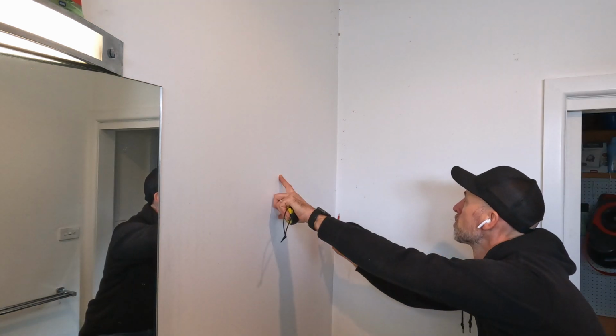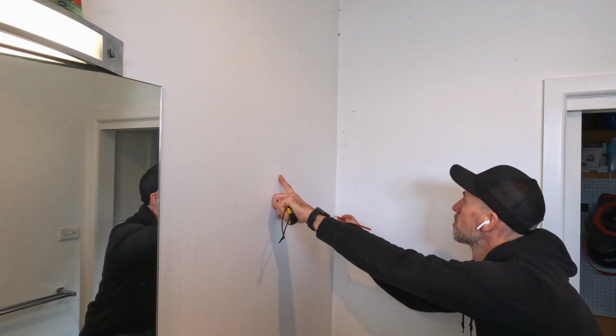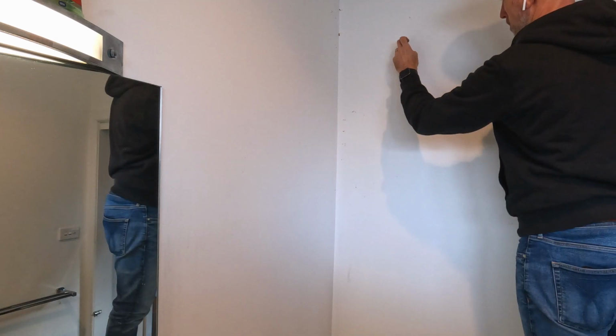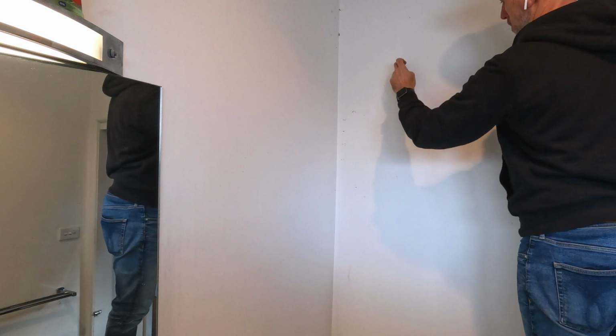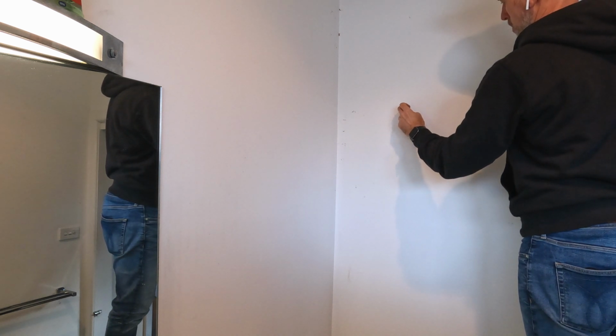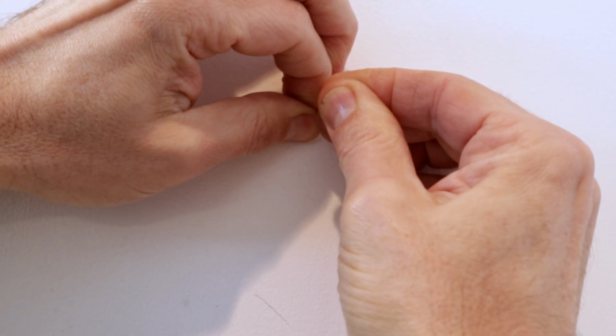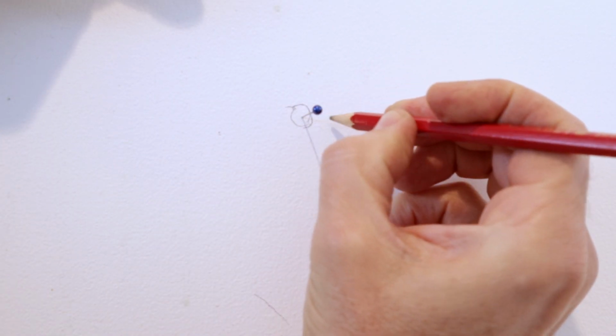I've never really had much joy with stud finders. I tend to use the tap and pin method. That is, tapping until the open sound tightens up. This means there's something behind the wall. Then I use a pin to push through the plaster. If there's a stud, it sticks fast. If not, the hole is too small to notice.